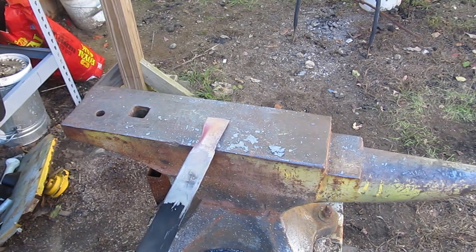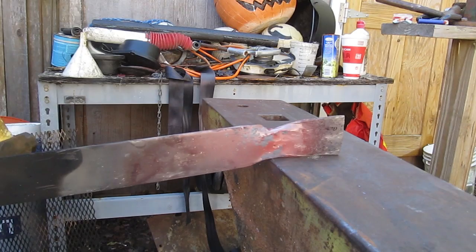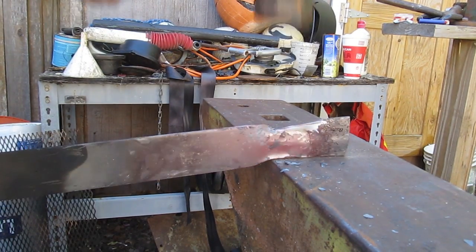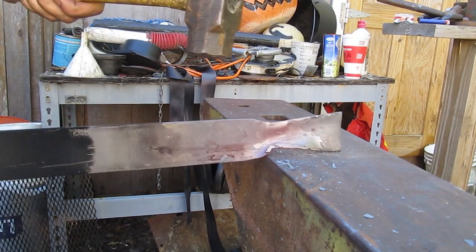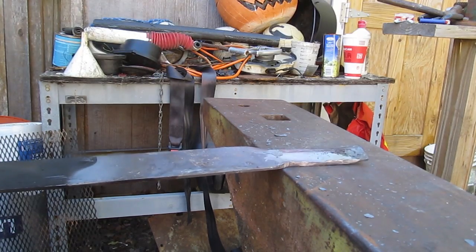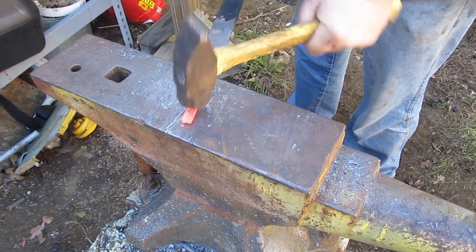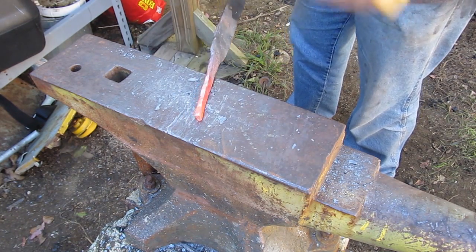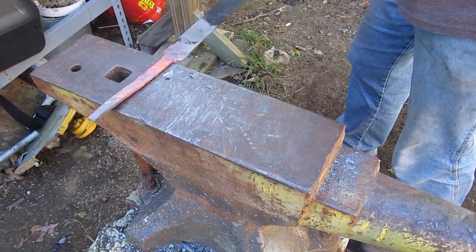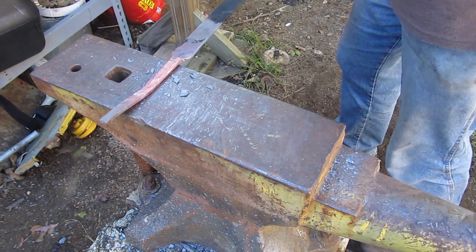Next I'm doing near-edge hammering. What that does is it reduces the size of the steel over the anvil — that's how we're making the tang. The tang is the part where the handle goes over. This is the other end of the sword from the point, and now we're drawing out the tang, continuing to heat and draw it out to make it thinner and longer. That added a couple of inches to the sword because the steel has to go somewhere.